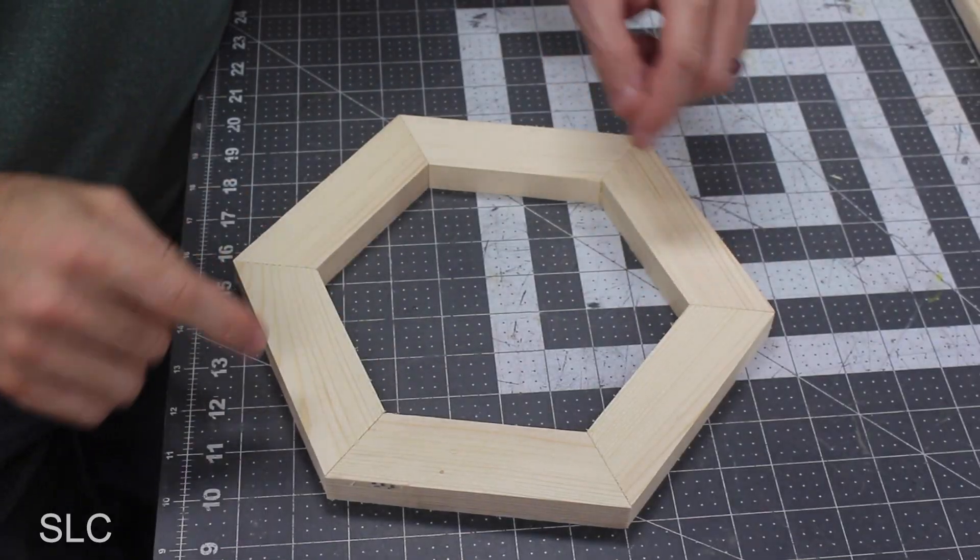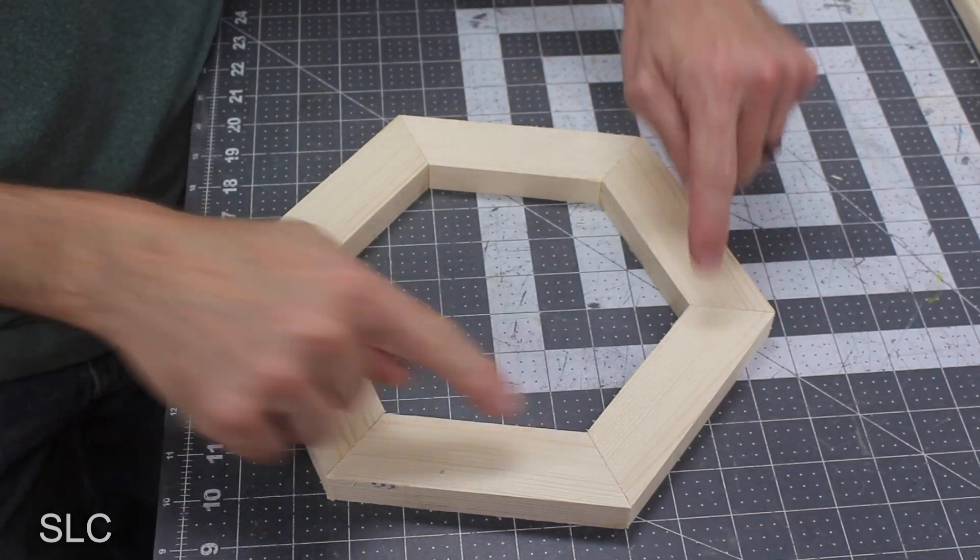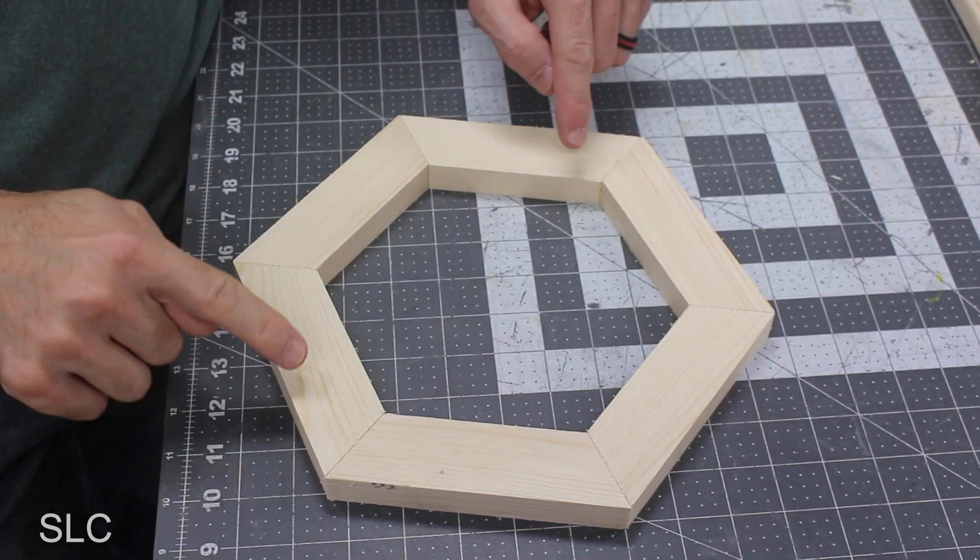And I'm just going to repeat that process until we run out of wood. I ended up with 30 pieces from that scrap piece of 2x6 — so you can get a lot of these sides from just a little bit of lumber. I've taken 6 of the pieces and lined them up end to end, and as you can tell there's very minimal, if any, gap between them.